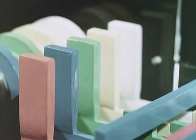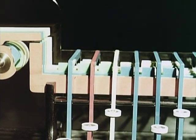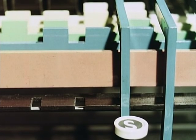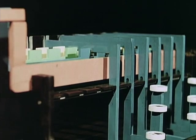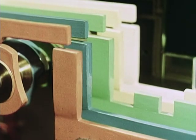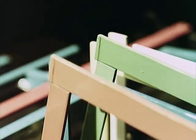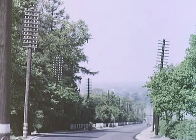How is the code set up in the transmitter? These bars extend right along the keyboard. Across the top of the bars, parallel with each key, is a row of projecting teeth. Suppose the letter S is struck — we see it move down onto the bars. Springs pull the bars to the right, but the key stops some of the bars from moving. The code for S is set up. Instantaneously it is set up in the receiver also, carried by overhead wire and underground cable in the form of five changes of current which make up the code.